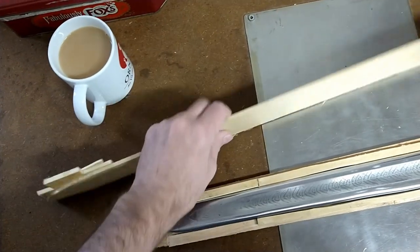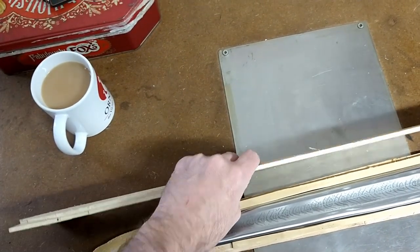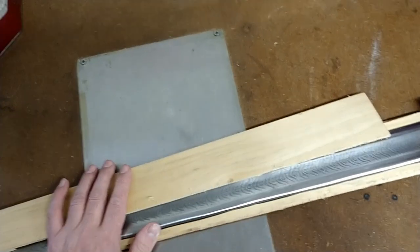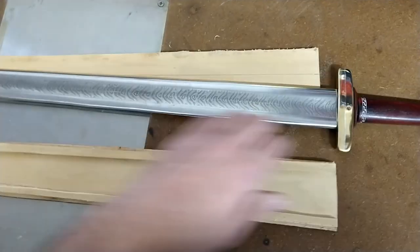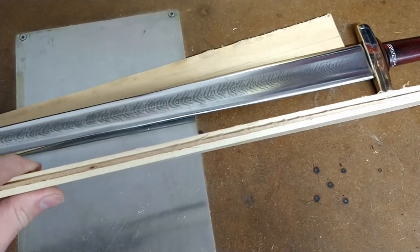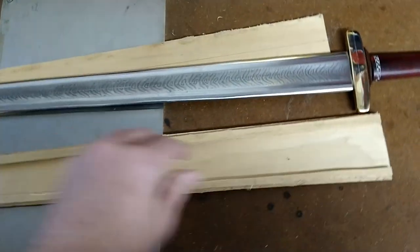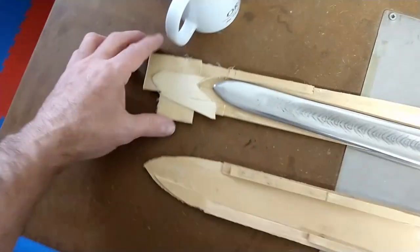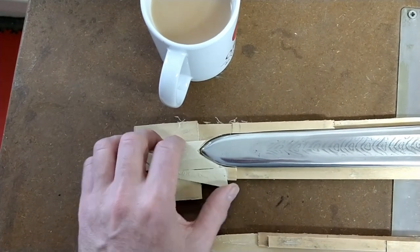The originals are normally two bits of wood that have been hollowed out with a chisel and shaped so they have a curved profile and sit either side of the blade. But you can do this with modern power tools if your woodwork's not great, by having one flat piece either side. What I've done here is glued on the back of each piece one or two strips to build up the thickness - just cut thin straight laths and glued them directly on. You can even make pieces up in chunks; it doesn't really matter.